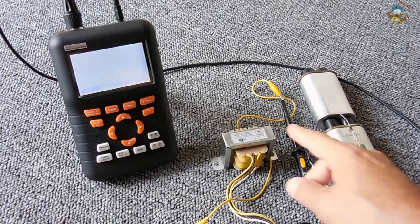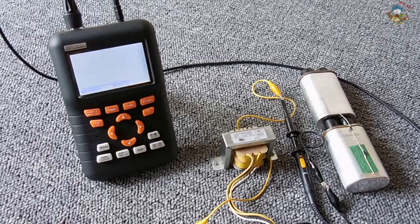For the demonstration I'm going to be using the 16 volt AC one and a quarter amp center tap transformer. Later on I'm going to give you a demonstration using a microwave oven transformer which has an output between 2000 and 2500 volts. We're going to be stepping that up to 5000 plus volts — the voltage the magnetron would see once the voltage has been doubled. You'll see the difference between the 2000 to 2500 volt output from the transformer itself, and then once the voltage doubling circuit is connected, the output will be over 5,000 volts.